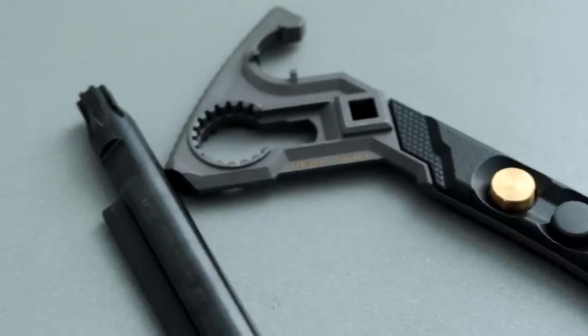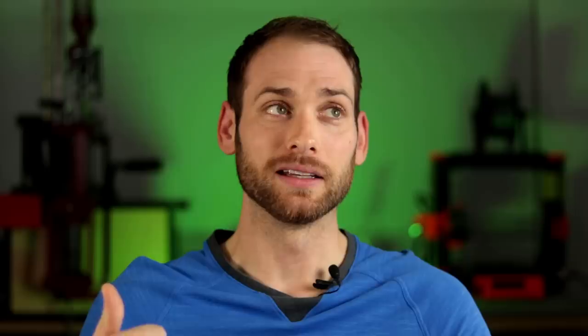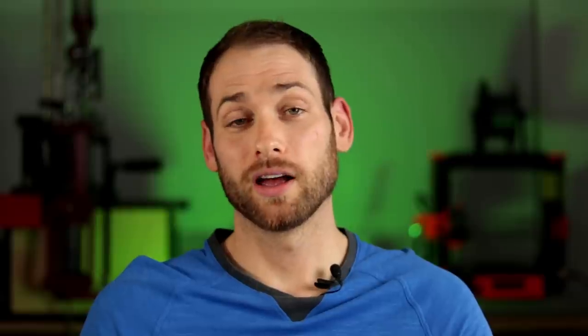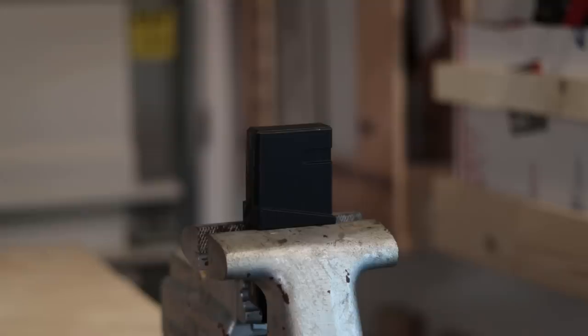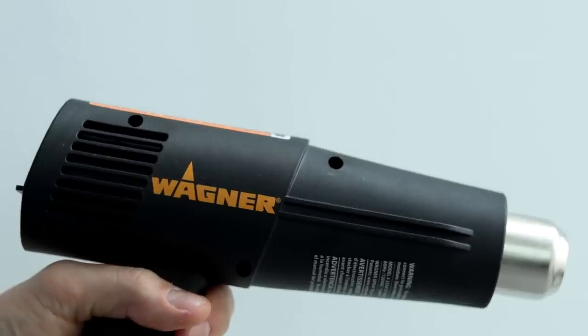In addition to guns and ammo being scarce in mid-2020, so were a lot of the AR armorer's tools. Some of the stuff I was looking for wasn't readily available, so I put this thing together with exactly zero correct tools. I didn't have a castle nut wrench, so I used a pin spanner from my lathe. I didn't have an upper receiver rod or reaction rod. No roll pin punches either — just brass punches and regret. The one thing I did have, only because I have a 3D printer, was a 3D-printed nylon magwell vise block, which worked out super well. Also had my heat gun — the devil's blow dryer — which is awesome for removing muzzle devices.